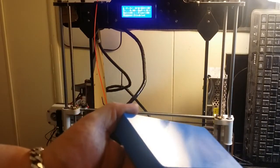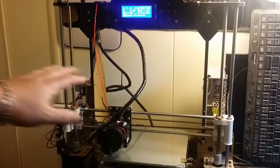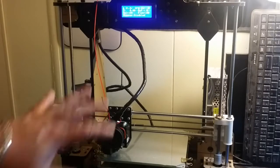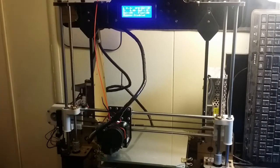And you don't have to replace the hairspray often. You do replace it after a while, it's hard to say, when it stops working. I've only replaced the hairspray maybe 2 or 3 times since I started, so maybe every month or so you replace the hairspray, which is easy. You just wash it, it comes off with soap and water, dry it, and reapply the hairspray. So it's a lot cheaper, it's a lot easier to work with, it lasts a lot longer, and it gives you a better finish. Glass and hairspray is where it's at.